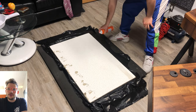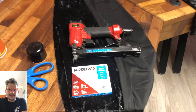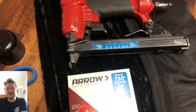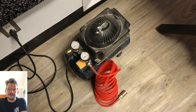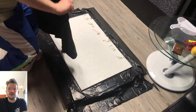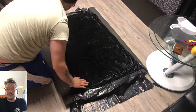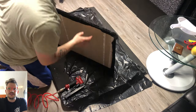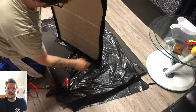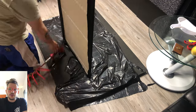I'm just applying a full coat of adhesive to the front face of the ceiling tile. You want to give that about a minute to get tacky before you put the fabric on. Here is the stapler and staples that we're using and the little air compressor. You can use a handheld stapler if you like, but I just use the air compressor stapler — it's a little more efficient. So we can get our fabric put on, just making sure there's no wrinkles on that front face. Then I can flip it over and just staple around to the backside just to keep that fabric secure. Once we work our way around the entire panel, that tile is upholstered.